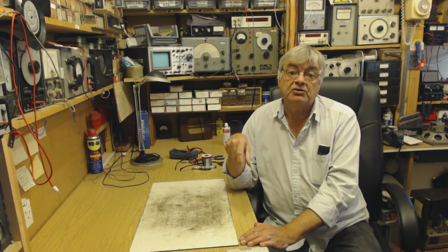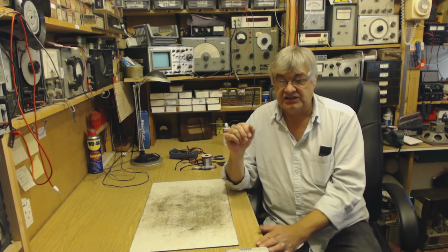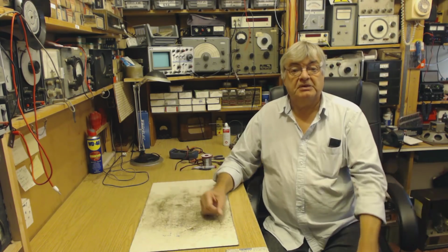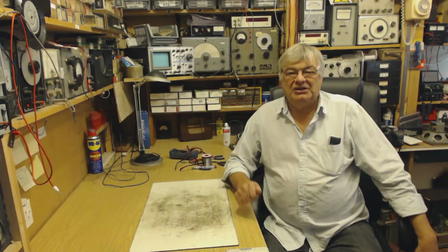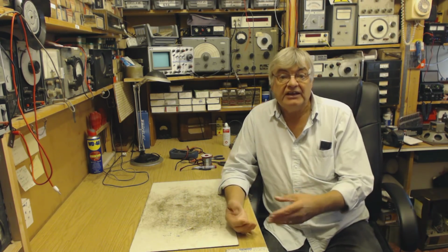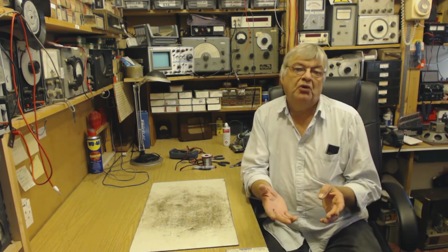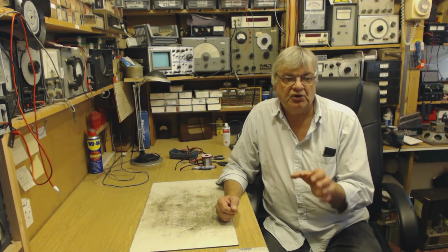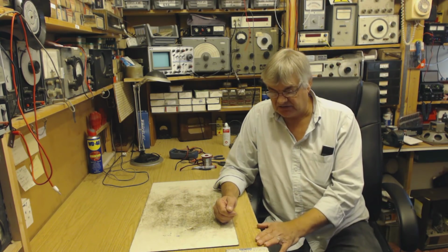A few years ago, being a radio amateur, I was transmitting on AM. There was an AM net, not single sideband as most of it is now. And my next door neighbour came round and said, I can hear you on my hi-fi through the speakers, perfectly clear. Every word you're saying. So I said, yes, sorry about that. His speaker cables were acting as an aerial. Now my transmitter wasn't at fault. If anything, his amplifier's at fault, because it's picking up RF, the amplifier is detecting it as a radio would, and then the audio is going to the speakers. You can hear every word I'm saying. On single sideband he wouldn't have heard it clearly, he would have just heard a dreadful sound, but you know what SSB sounds like possibly.